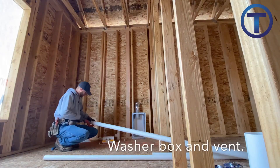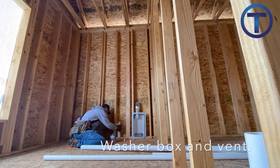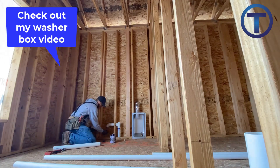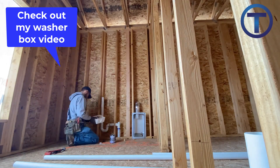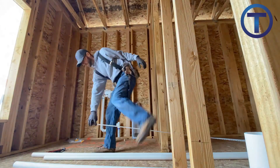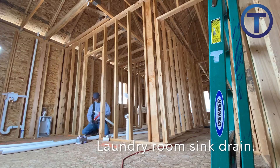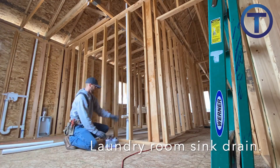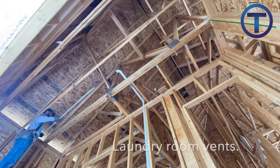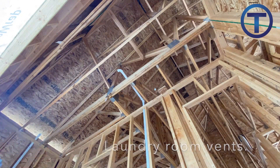This is the washroom where I'm going to install a sanitary tee, a P-trap, and a washer box, and I'll run the vent up from there. Check out my other video detailing how to do washer boxes — it gives all the heights and measurements I typically use when installing those. This washroom also has a laundry sink on the other side of the room, so I'm going to run a vent up for each one and connect those vents together up in the trusses, where they'll also tie in with the other vents and run out the roof.